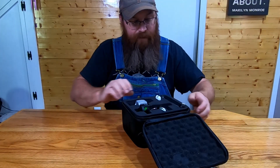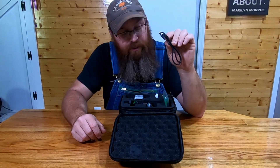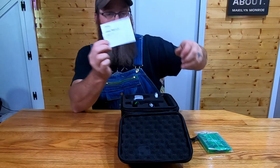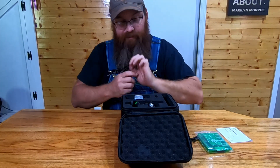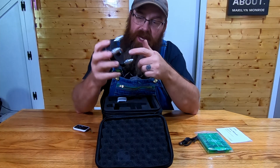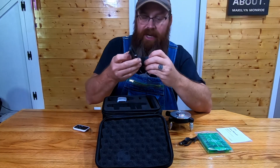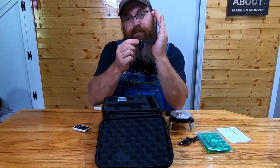You can carry it and protect it — there's foam padding in here. Right off the bat we're going to pull the charging cable out. This is a USB-C charging cable, so you can charge this using a phone charger in your car or whatever the case may be. We've got a green card here that's going to assist with being able to see that laser line and get everything set up. There's a user manual, a remote — which is pretty neat, I haven't seen that on a laser before. We've got a tripod stand with what looks to be a quarter-twenty on the top and a 5/8 thread on the bottom, so if you have a grade tripod this will screw right on. We also have an L-bracket with magnets in the back so you can attach it to a metal pole inside or outside a structure.